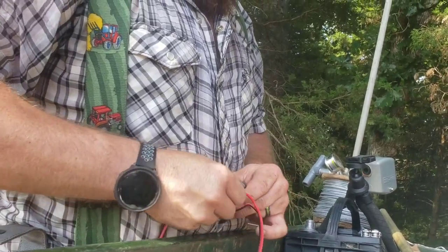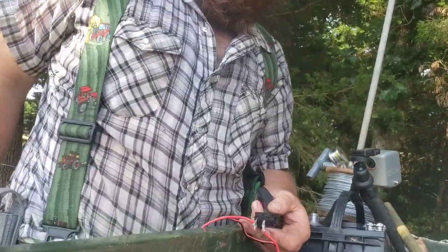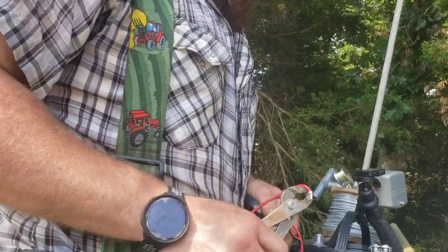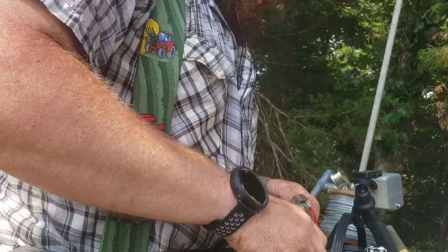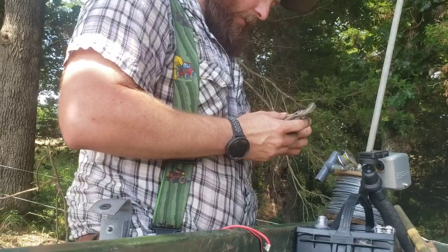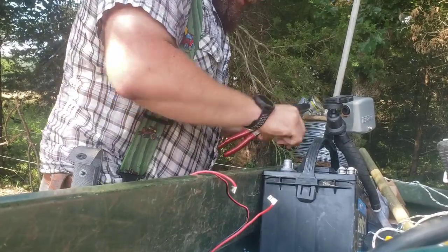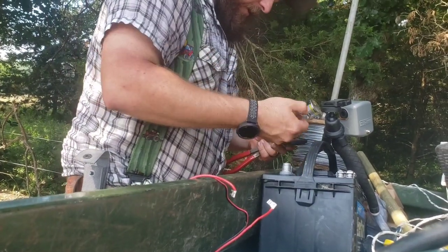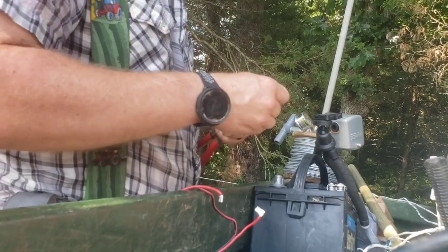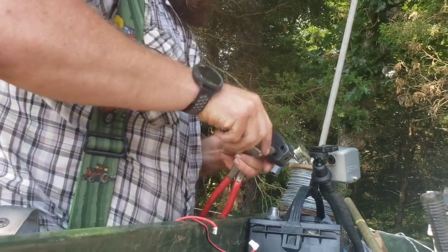You're not even gonna use that thing on the outside? I'm not going to use a switch. No, I don't need it. We'll just hook this up inside of our pressure switch right here. And we'll leave the black wire on the outside and just bypass it directly, and all we need is the hot in there to make contact. I've seen them hooked up both ways, but from what I read and watched, it's really not necessary to have the black wire in there. You really just need the one on a system like this, from the best I can understand.